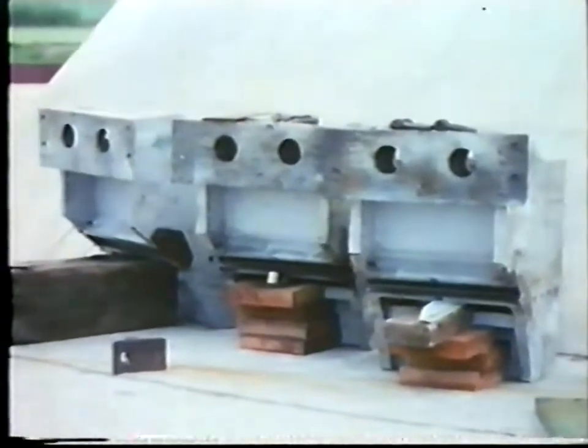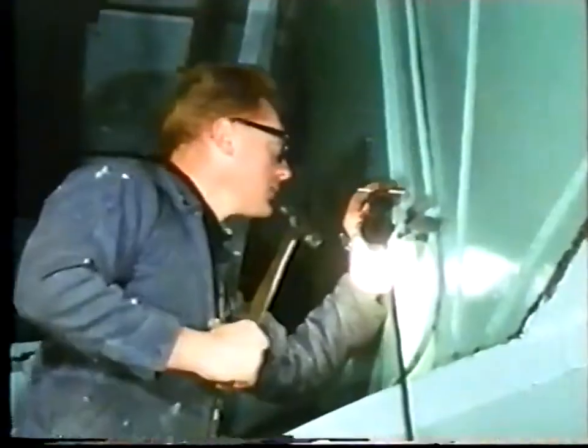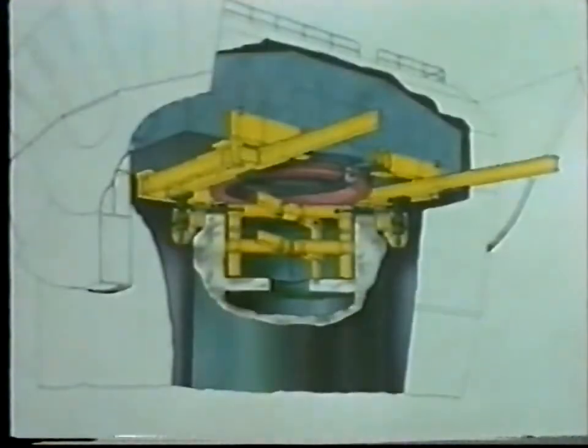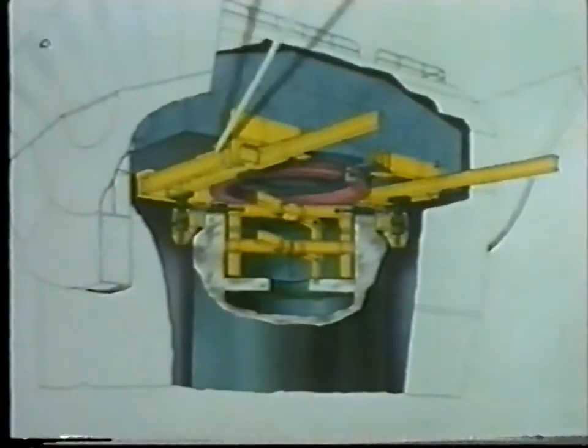Through this slot, each of the four jack pedestals, weighing over one ton apiece, had to be threaded on a porter beam past the internal machinery to its seating on the tower. Manoeuvring the pedestals along the beams towards the slot was made easier by the use of a mobile hydraulic platform — a cherry picker — used for inspection at all stages of the work, however awkward the angle. The pedestals were eased through the slot into their final positions, with care taken to avoid damage to the azimuth drive pinions which mesh with the gear wheel cut on the surface of the bearing.